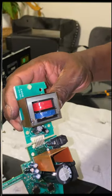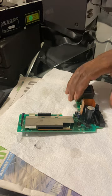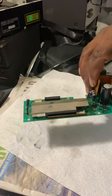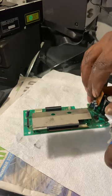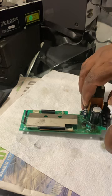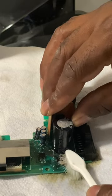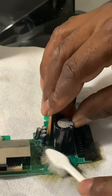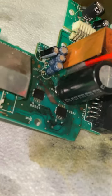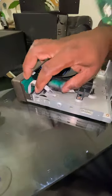So what I'm going to do is clean it off. I'm going to use this brake and clutch cleaner just to get rid of this fluid, whatever it is, because it's obviously shorting the resistors. The unit's warm when powered on, but as you can see before, it was not powered. I've sprayed it — it's broken most of the liquid down. I'm just going to give it a brush, and you can see the liquid coming off there.